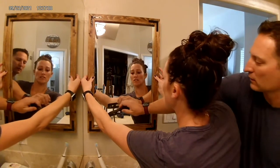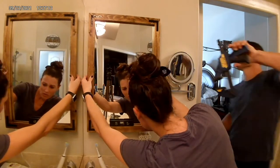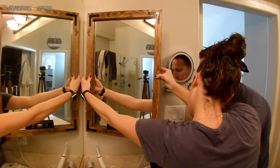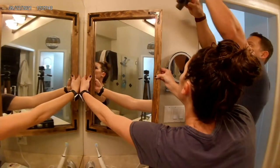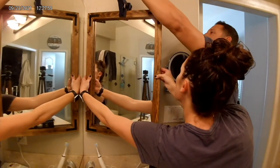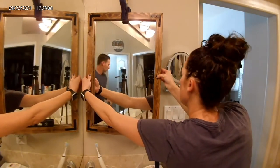Once you've got adhesive all the way around the edge of the mirror, it's time to place the frame. Getting it on there nice and level is very important. I suggest using a small level that you can place on the inside of the frame while you're trying to make small adjustments. Also, make sure you do a practice open and close of the medicine cabinet before you clamp it on and let it dry.